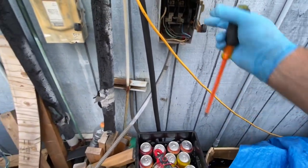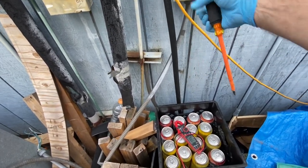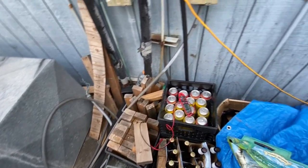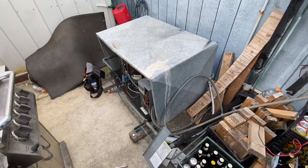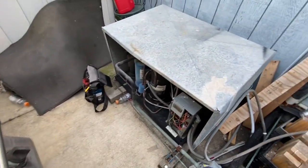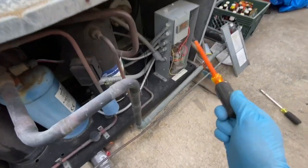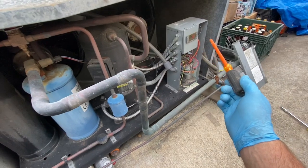This disconnect's old as the moon right here. You always want to close these before you throw the knife. Let's see what happens. Nada. Oh, there it goes. It's going to do its three pump outs because of the control. We're going to pump out any liquid that's in our compressor, then we should try and run.